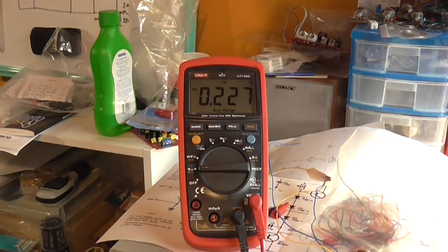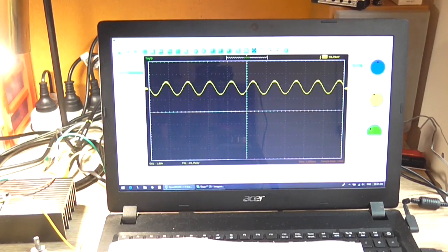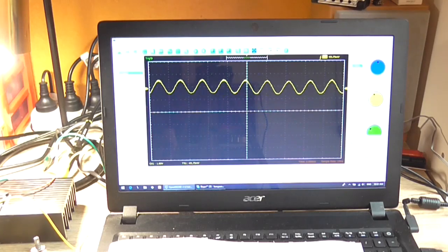Okay, all right, we'll hook back up to the scope, turn the amplifier on. Nothing unusual. I'll turn the DDS on and make sure I've still got a signal. Notice how the DDS is pretty noisy on its output. And yes, I've got an output, albeit now it appears to be a little bit not stable on its signal output.